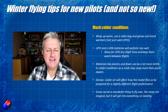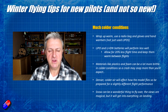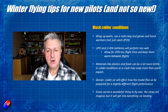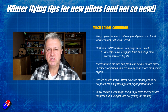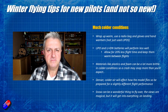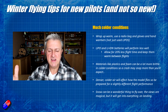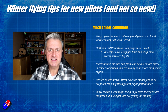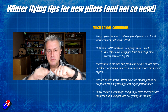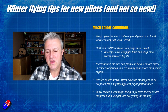Be careful if you land and get mud inside everything. If it's reasonably wet mud I would stop flying that model and take it home to let it dry out in the centrally heated house. Once it has, use a soft brush to get as much off as possible. The issue is that a lot of fields have bits of old iron mixed in with the ground, and that rust will get sucked straight into the magnets if you agitate it — which can be a disaster for multi-rotor motors. Bring it home, let it dry, and then brush it away onto paper underneath it, not into the magnets themselves.